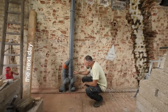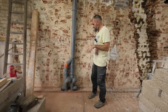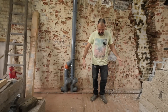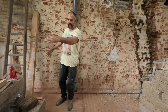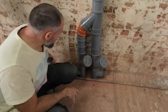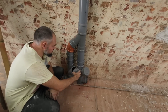I finished assembling the first stage of the sewerage system. We are on the first floor. This part — all these fittings — is for the toilet. It will be a toilet here. And here it will be a bathroom. So this is for dirty water, and this is for grey water. Here there will be insulation, and this pipe will be hidden in the wall inside the insulation.